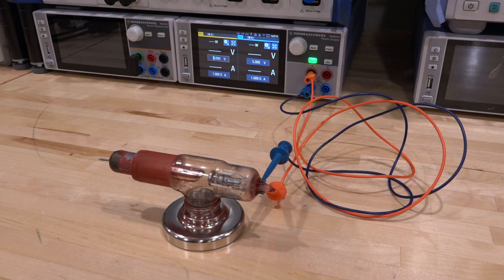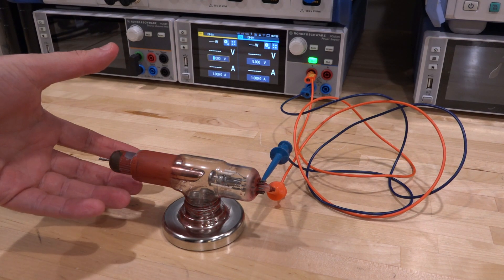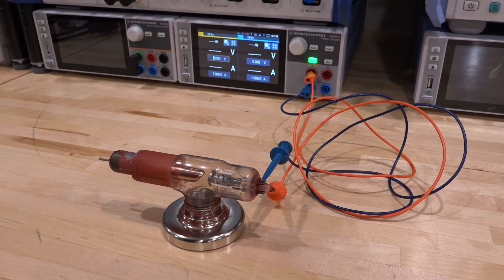Now, we can also turn on the heater and see it glow. And this obviously does not produce any x-rays — it's no different than turning on an incandescent light bulb, because we have no high voltage here to accelerate the electrons. But maybe if you peek through there, we might be able to see it glow. Let's go ahead and give it a try — turn it on, put an amp through it, and then maybe it will glow. There it is! Look at that — we can see it indeed glow in the background. So the element is certainly working. The problem is something else that's causing the high voltage power supply to clamp down.